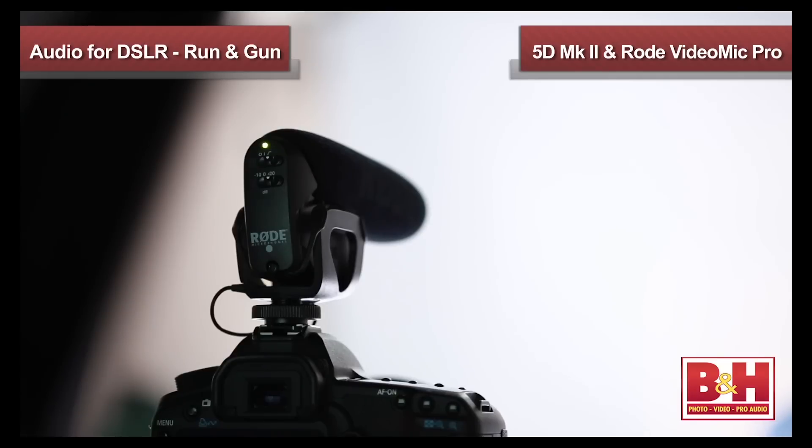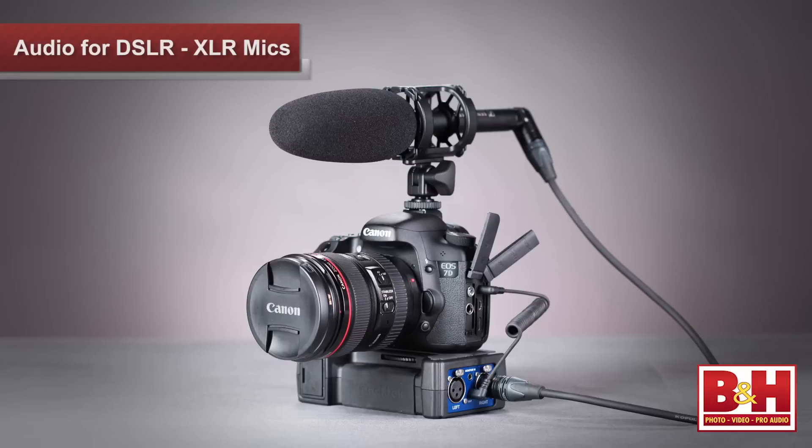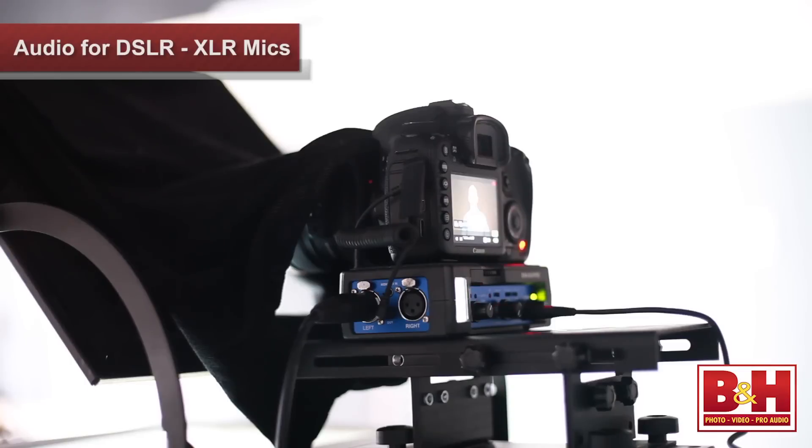Hi, I'm Rob from B&H, and this is the second in a series of three videos we're doing to help DSLR shooters get better quality audio in their productions. In our first video, we looked at inexpensive microphones that mount right to your camera and output audio to your DSLR's eighth-inch mini-input jack. Now we're going to talk about using professional-grade XLR microphones on your DSLR shoots. We'll talk about different types of XLR mics used in video production, and we'll show you how to use XLR adapters to get signal from those mics to your camera's mini-jack input and record to the camera's audio tracks. In fact, instead of our usual video camera, we're shooting this video on a Canon 7D, and our audio is being recorded on its audio tracks.